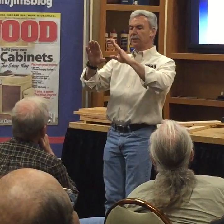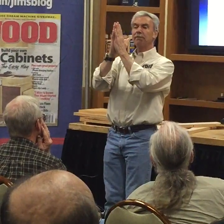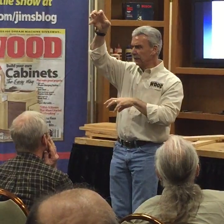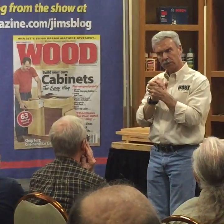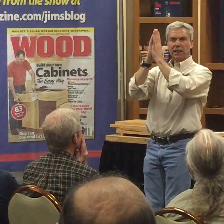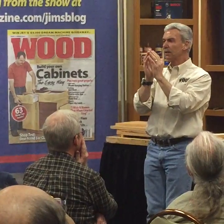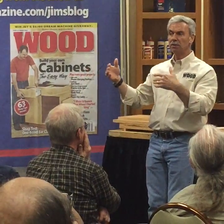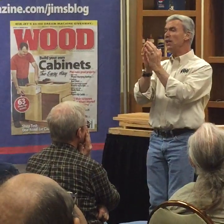Because the thought at the time was that when you put boards together that touched at the top and bottom, and were away a little bit in the center, when you clamp the center, you put more pressure at the top and bottom, which made it easier to clamp that, because it's hard to clamp at the very top and bottom. The technique was called a spring fit at the time. Well, I know this is human emotions kind of thing, but we have great clamps, and we can take a board that's away an inch at the middle and clamp it together. But for the life of that project, we're asking the glue to keep that board from going back to the way it always was. So again, I know you're not supposed to do that, but I believe the board has a sense of humor. It lets you think for a short time that, yep, that worked, and yet it's not going to. It's going to go back. So you let some tension in there.